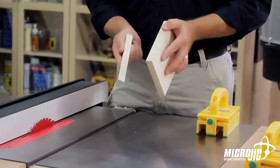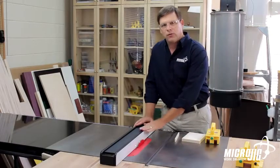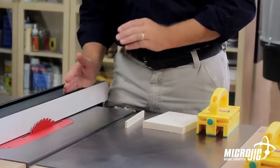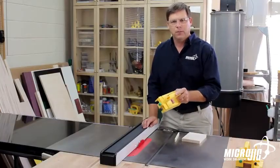To get this level of accuracy, safety, and cleanliness in your cuts, you need three factors. You need your table saw set up properly with the rip fence exactly parallel to your blade. You need a good quality ripping blade, and you need the control that comes with the gripper.